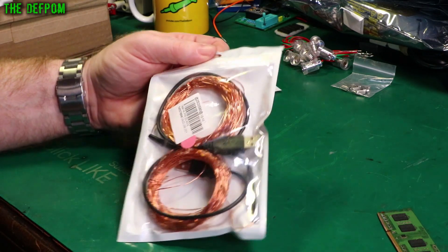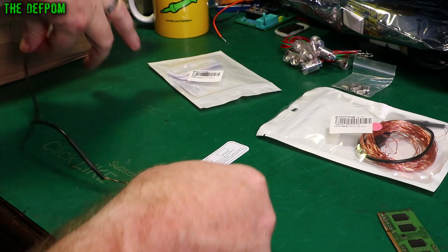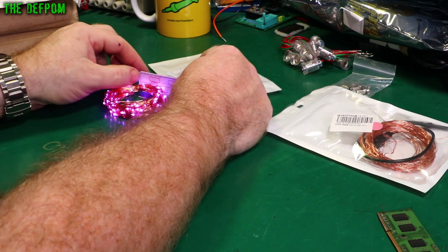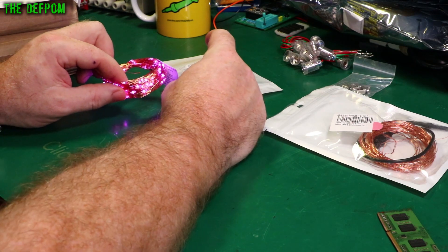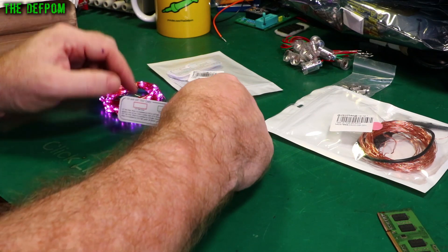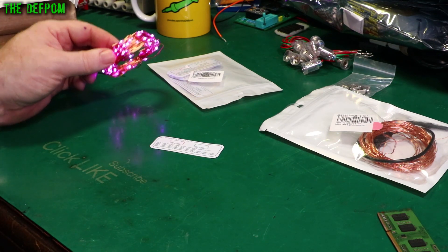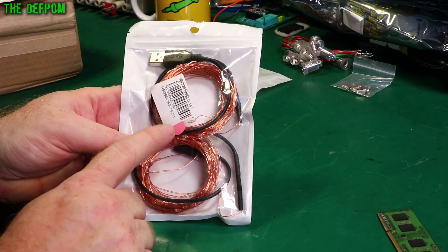This is actually one of the reasons I got the UV test card - because these are supposed to be UV black light LED bulbs on this string. Let's plug this in and see what happens. I've plugged these in. Let's hold the test card up and see if anything shows up. To me they didn't really seem like blue LEDs - they seem more like pink LEDs. No effect at all. As expected, these are pink LEDs, not UV. And if you look on the packet, it's also got a pink dot on it - that could be a giveaway.